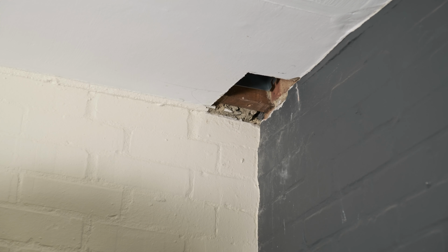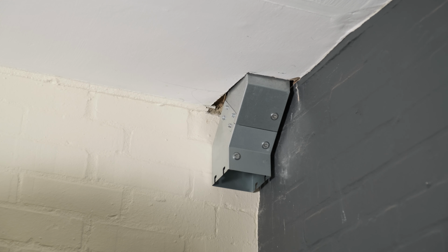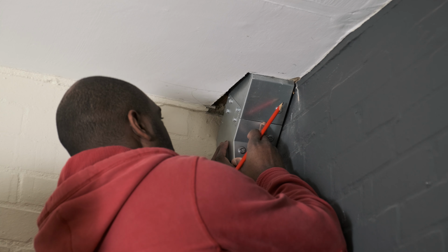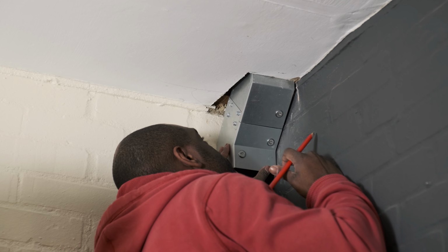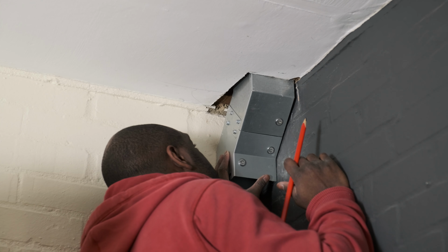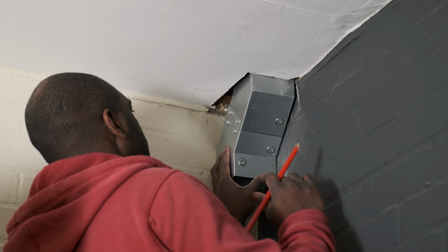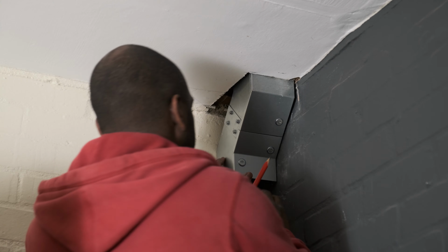With that bit of board removed, I'm moving on to assembling the offsets and dropping them in from above. I'm positioning the offset so that I can slide a piece of plasterboard back in behind it to close the gap. The bonus side effect is that the offset straightens before going into the ceiling, which gives a visual indication of where it's going.